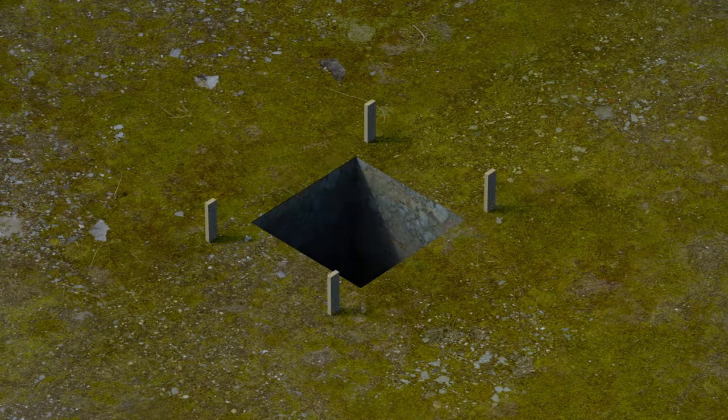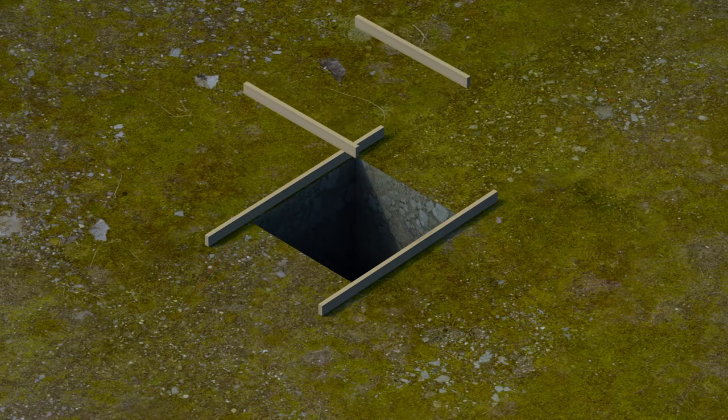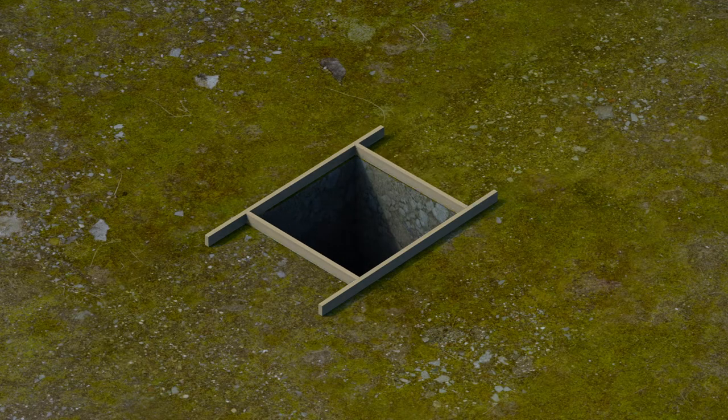Additionally, you will need 4 stakes approximately 12 to 24 inches long for the corners of the frame. Make a line 10.5 inches from each end of both of the longer pieces of lumber. While ensuring the frame remains square and flat, place a 36-inch piece of lumber between the two longer pieces at the mark. Repeat with the second 36-inch piece at the second mark to create a 36 by 36-inch form. Secure all four pieces together with wood screws.